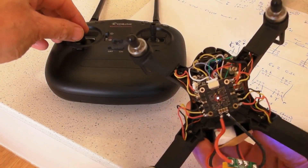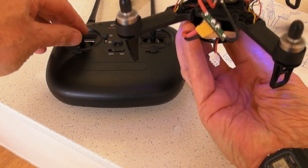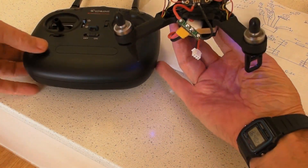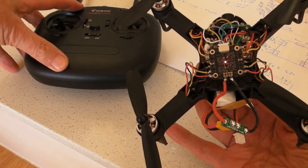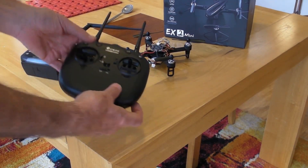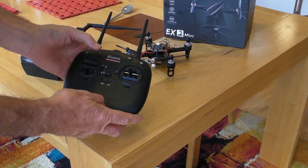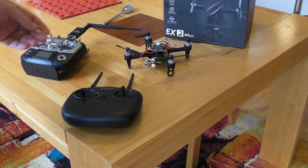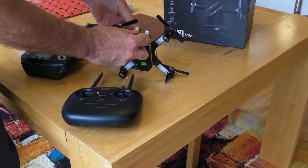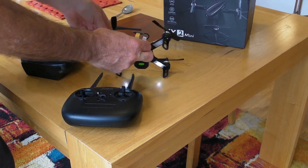A red light turns on instead of the new board indicator — that's running. So this is a fairly elementary test that the props are spinning the right way. That's simply by holding a piece of newspaper underneath and revving it up, and seeing if you're getting downdraft from each of the props. Because it's quite difficult looking at the props to be quite sure which way they're spinning.